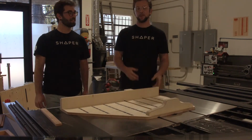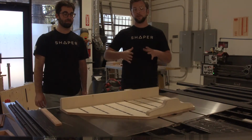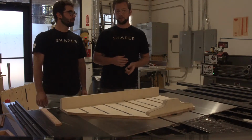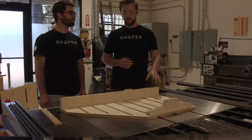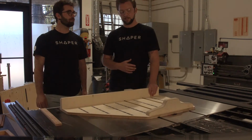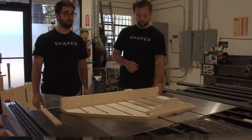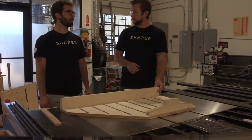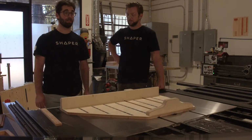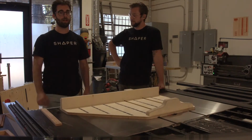And so when you're approaching this project, consider the thickness of your ply and creep up on that final dimension. We'll go over it later when we actually cut these pieces, but I ended up using a positive offset to nail this fit, so I didn't even go to a 0-inch offset. And that's I think perfect. Nominal ply in the States is 3/4, but typically what we've been getting is 0.69 or so inch here. Yeah, and 0.73. If you double that up, you're an 1/8 inch off. So great thing about Origin, just use those offsets to dial it in as you go.